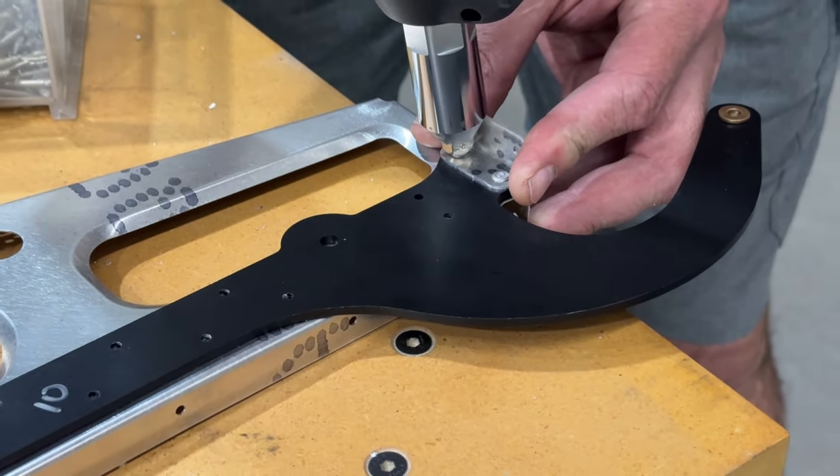Next step — I've got to get this off the table, bring the skin up here, and form the leading edge of the skin. The top skin goes on first. Really, now that I've done this wing, the right wing is going to take about half as much time. Honestly, I think I could build a wing in a weekend — there's just not a whole lot going on here. I got the aileron and flap mounted up as a sanity check to make sure the hinge arms were placed in the right locations.